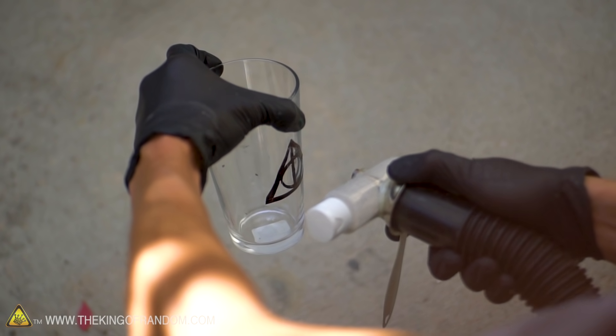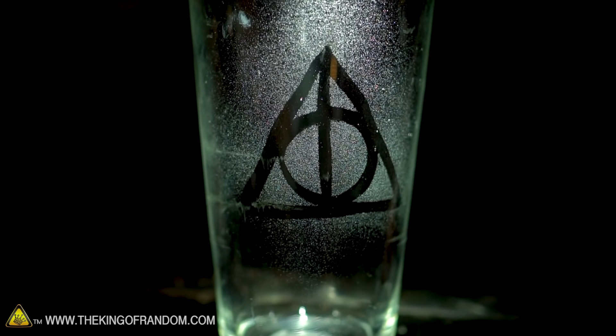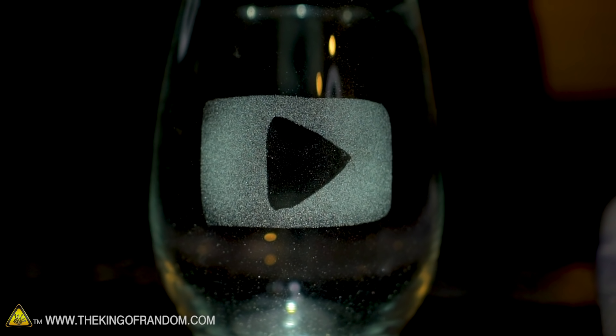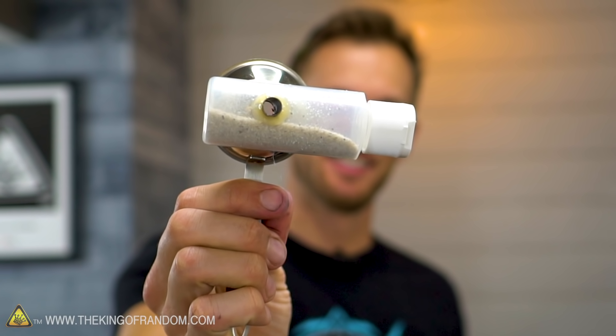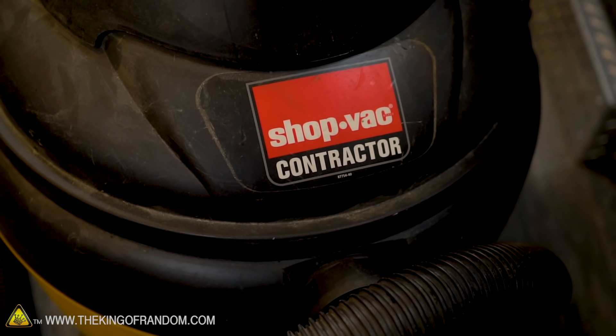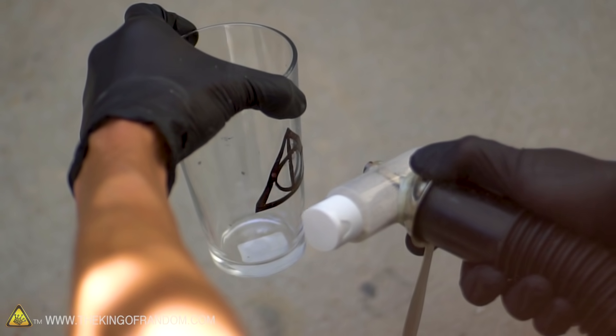What's the verdict on our funnel paint bottle sandblaster? It works — it works surprisingly well. In fact, if you just want to do some glass etching at home, you can get kits with a paste or a very expensive air compressor, but this took us 20 minutes — less than $5 if you have a shop vac, and you're more likely to have a shop vac than an air compressor. It's the even quicker, easier sandblaster that requires less equipment. The most expensive part of this project is, of course, the shop vac. The funnels themselves are about $3.50, and then sand. This tool really works, guys — it's amazing. You can build one of these. Just use it outside because your sand is going to go everywhere — it's easier than building a blasting cabinet.